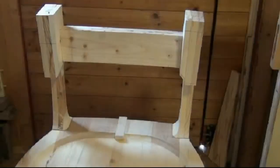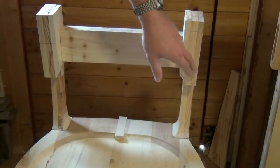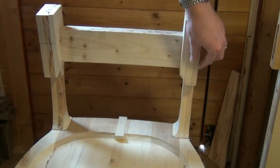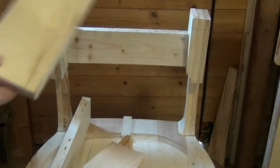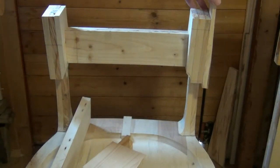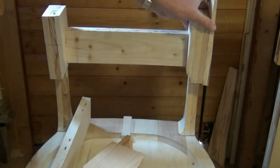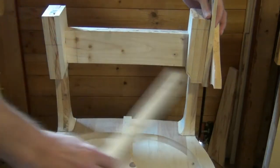Welcome to the workshop. Last time we cut the backrest to fit. Next thing is to laminate some boards to make up the arms. There's quite a difference between the side of the back leg and the position of the front leg, so we need to build out a lamination thick here and then gradually tapering down to the front leg. If we attach the cutoffs we took from the lower end of the legs, we can bring the sides of the chair at the top of the rear legs back to perpendicular to the floor, then build out with some extra material.